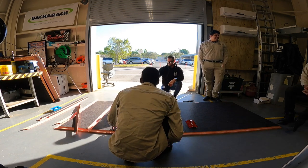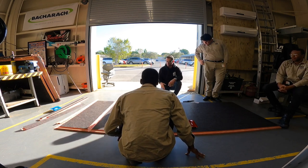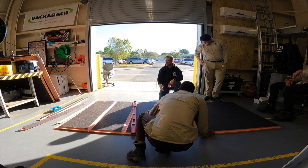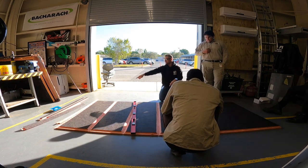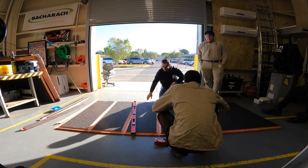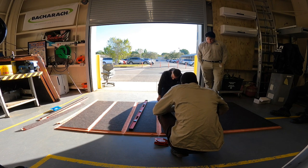So we've got 15, 15, 15 — the last cut is going to be 15 and three quarters. We're adding that extra, which is half of 1.5. We've got to add that on so that when we fold everything in, it fits perfectly into that first cut. That's where that three-quarter-inch extra comes from. So 15 and three quarters on this final one.